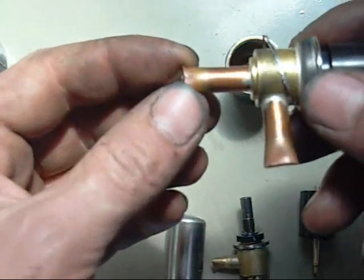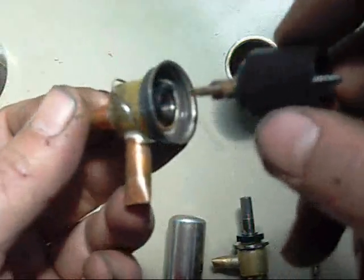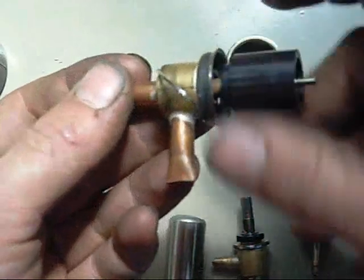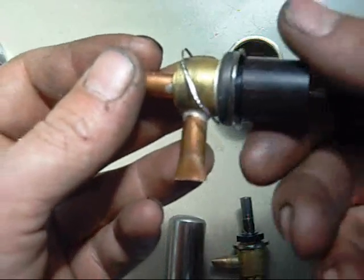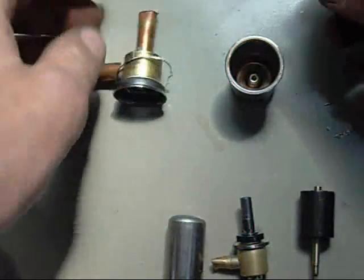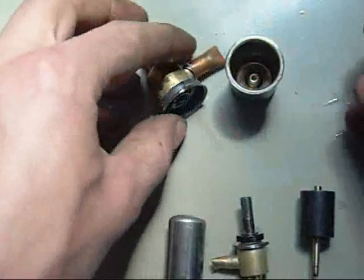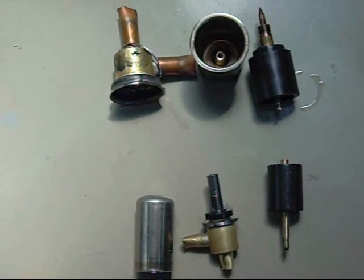The evaporation starts before the refrigerant leaves the condensing unit. It's a funny way these split systems work, but they work very well — very efficient. The unit will screw it down all the way when it starts up and then start winding it out, depending on how much refrigerant is required. And there you have it.